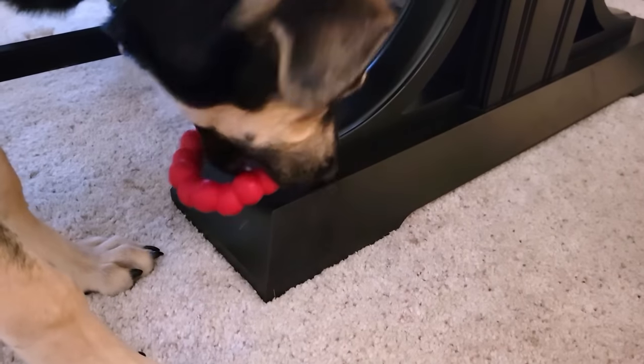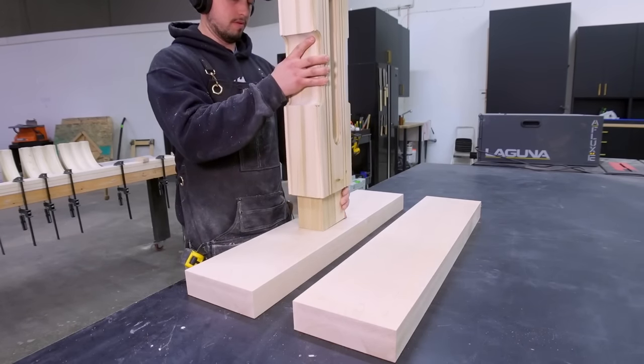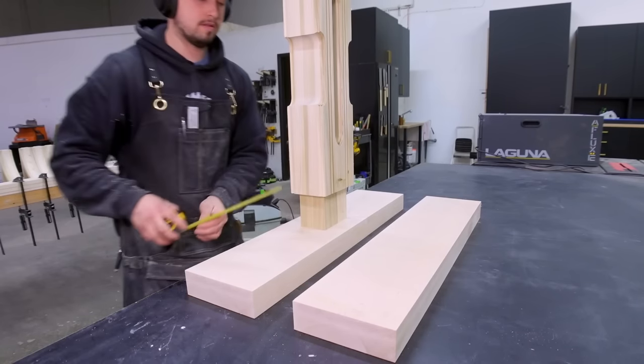The footings are made with thick laminated maple. The maple is much harder than poplar, so it'll stand up to kicking, chewing, and chair bumping a whole lot better. I will be cutting a giant mortise in the center of each footing, so once again it will be a lot easier if I rip Humpty Dumpty in half again.